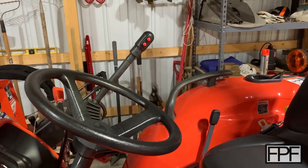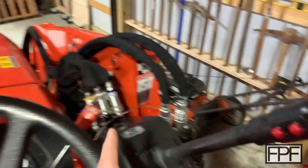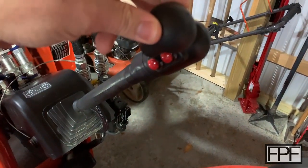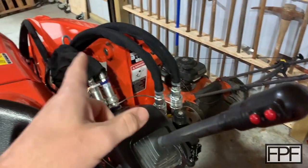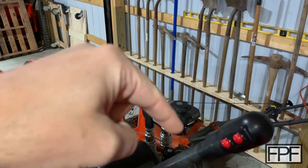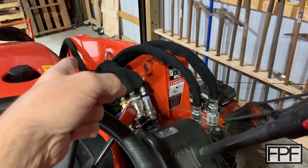I made a piece on here that adds on to a kit that I added, that makes it a lot better — a much cleaner install. This stick here operates the loader: it brings the loader up and down and tilts the bucket up and down so you can pick stuff up and drop it. Normally it's just a thin steel shaft that comes up with one of these on the top. To this machine I added a third function kit, which gives you two additional buttons and a couple of extra hydraulic lines that go down to the front to operate some sort of accessory implement. In my case I've got an auger that attaches to the front — pushing one button turns the auger in one direction and pushing the other button turns it in the other direction. It's basically a directional control valve and an extra set of hydraulic hookups in the front.